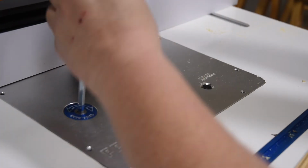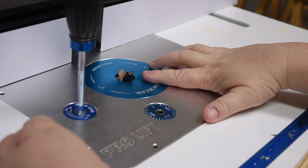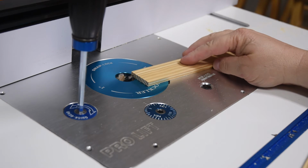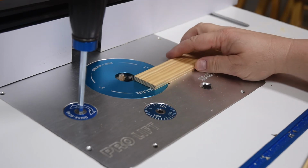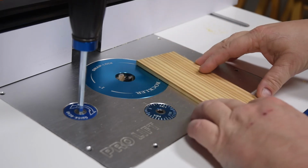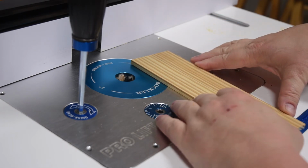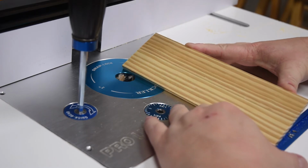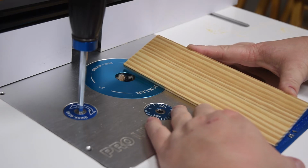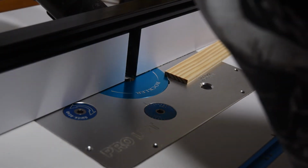Now I have this, it's going to cut a flat side and a flat top on here, and my objective in creating these lap joints is I want to take precisely half the height of this one, a little bit on one side and a little bit more on the other side. So when I bring the two together, they will overlap, but there will be a slight gap in between them, and that will give me that shiplap look. Right now, I could glue these all up together and have a really nice flat panel, but I'm just trying something. We're playing, and this is just a shop project. So let's try it out. Let me hit the shop vac.